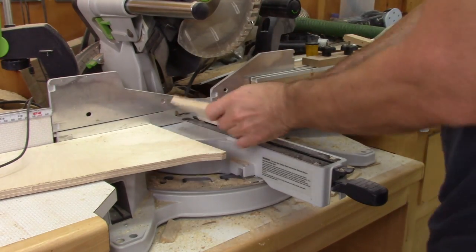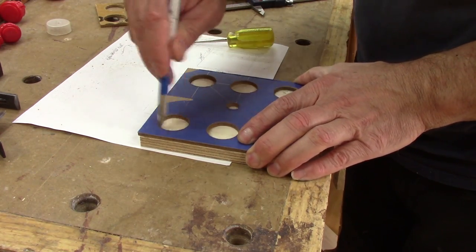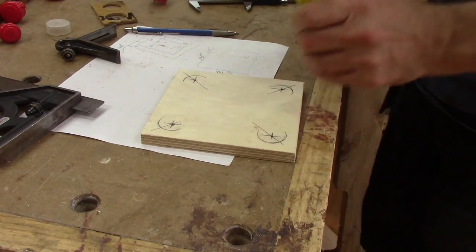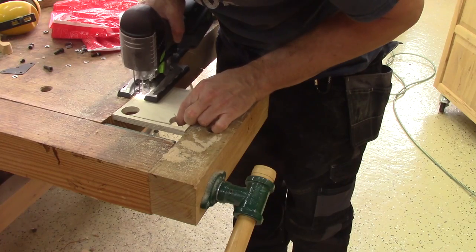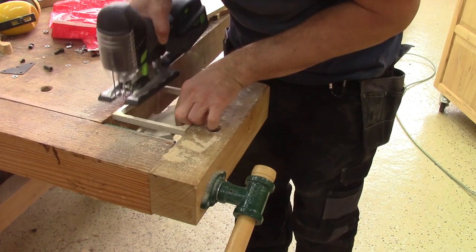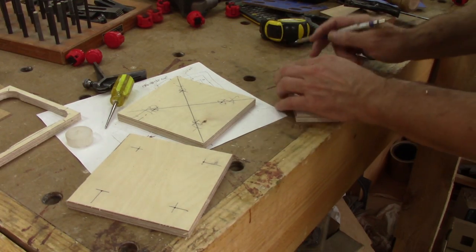The first thing to do is to cut the first piece. I use a pattern I've drilled to trace the shape I need to remove. When it's done, I drill the corners. Then I remove the waste. I redo mostly the same thing for the remaining three layers.